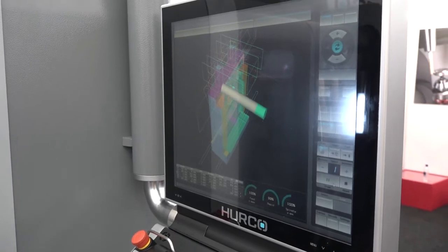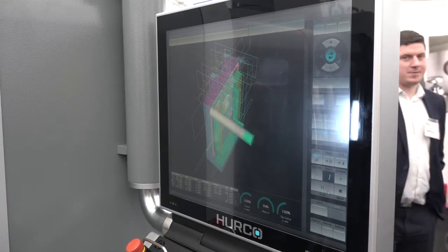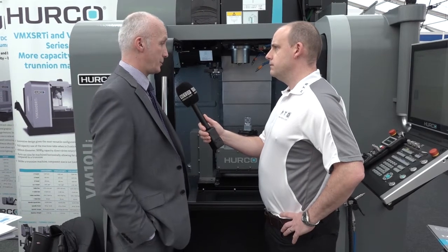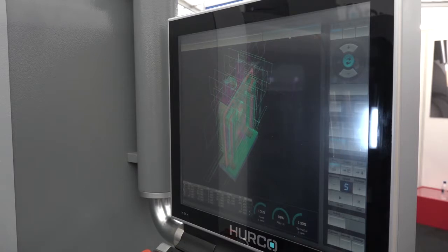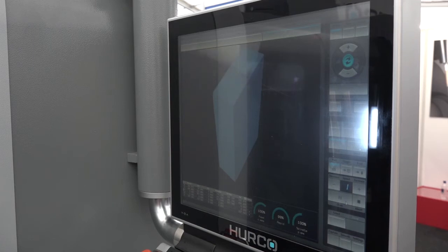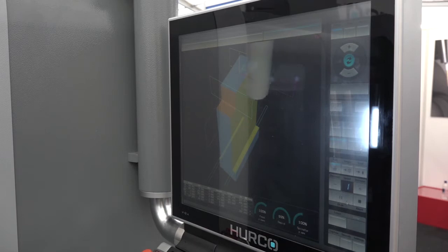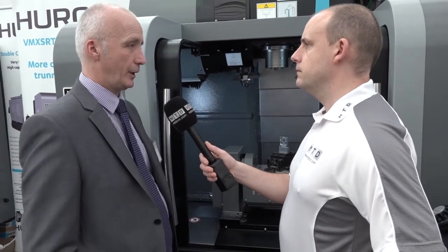You can use offline programming, but the MAX5 is certainly something to focus on. The control itself does allow you to program the machine five axes, all the way up to any kind of positional work. You can program it four axes simultaneous; if you're doing full five-axis you would obviously go to a CAM package. It's been designed so you can actually work at the machine — if you're doing prototype or development work it's ideal, because you can edit and change your program while standing at the machine, make the changes, cut the part, measure it, and continue as you would with any first-off part.